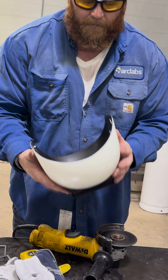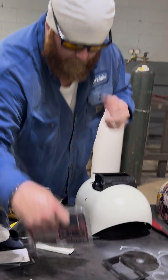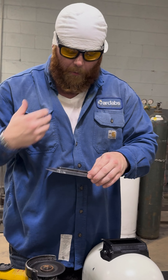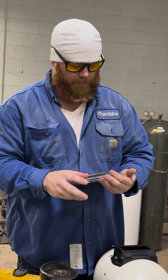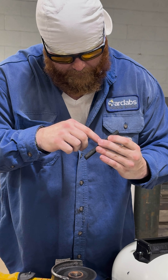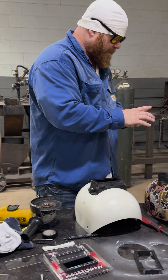Got the inside sorted. The lens we're going for today is the Viking series, two by four variable shade — nice choice. It's what I run personally. I like it because it doesn't flash me when I try to back feed. We're going to pull the tag — shade 10, right? I'm going to put brand new, fresh clear lenses in there.